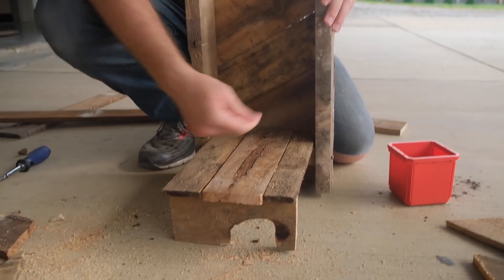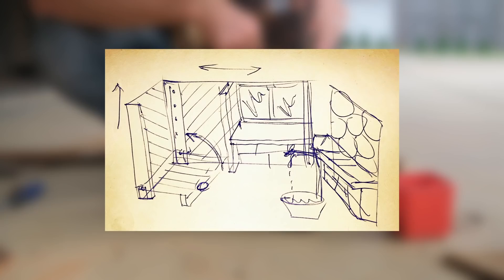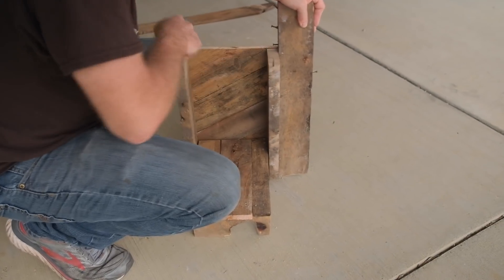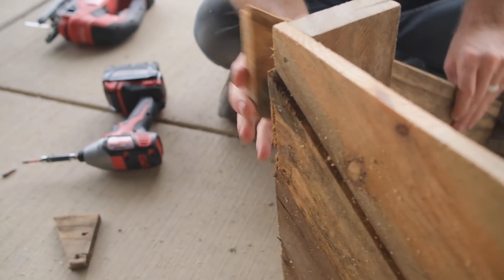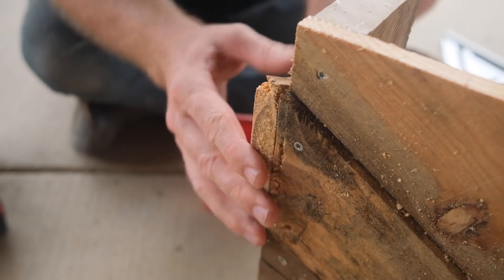So here's our back trim piece and our little guy. If you had a bigger cage like I did, I put some old tools up there. Now for this wall, we want to use the same angle but in reverse. That's going to give us a cool chevron effect between the wall that we currently built and the next vertical stud on the backside. I really don't even measure things - I'm like, okay, it has to be this tall. So I'm going to put this one in there, make a mark, cut it there, and keep moving forward. I eyeballed it. I don't know what angle this is, but this angle is going to match that angle. I'm going to use this same stud to attach these - just line that up flush and I'll have the same angle on this side as I do on that side.